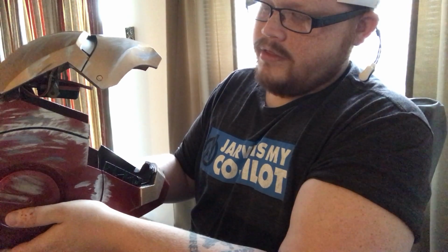However, like I said, it does have a manual mode. I have a touch capacitive sensor right here in the ear, so if you just touch it, it'll open for 10 seconds, and this is manual mode. Since I've used an Arduino board to program this, when the headset is on, the ear actually operates as an interrupt, so even though it might be receiving the brainwave activity from the headset, at any time I can push the button and it'll open for 10 seconds.